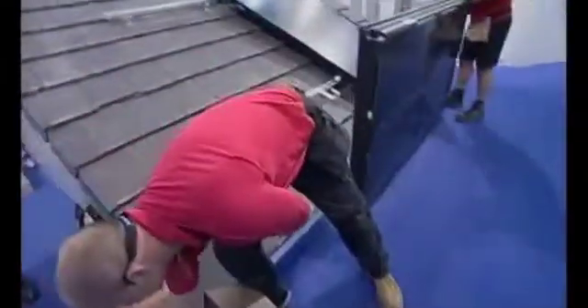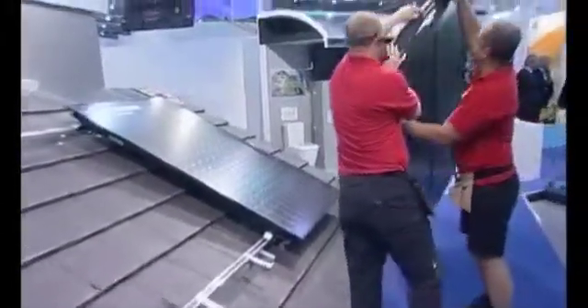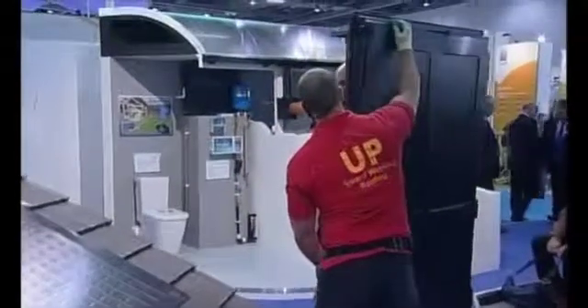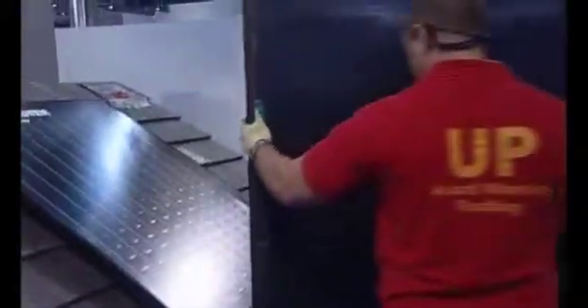The recommended sizing is one square metre of panel per 50 litres of cylinder capacity. For the two-panel installation shown here, a cylinder of around 210 to 250 litres would be a perfect match. Worcester Bosch always recommend sizing the cylinder slightly larger than the panels so there is always some solar gain being absorbed — the last thing you want is for the sun to be out but the cylinder already at temperature, as that is not good for the fluid in the panels.